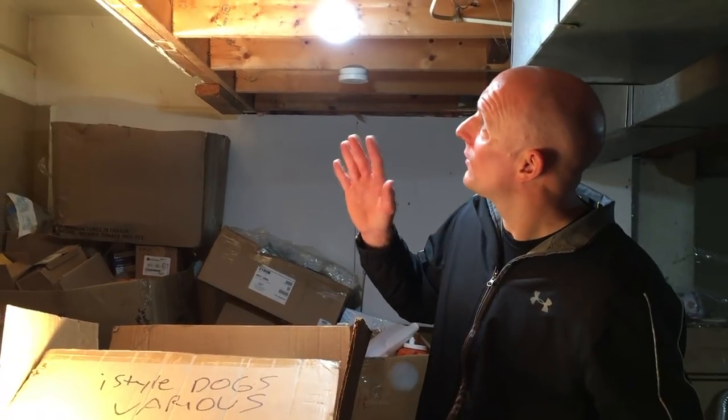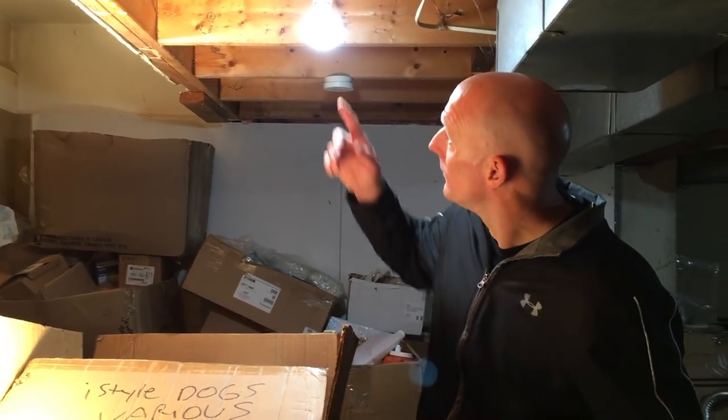We're not going to be using that. It's also a little harder for us in Canada to obtain these transformers. I've noticed on homedepot.com for people in the US it's very easily available right off the counter. Unfortunately for us in Toronto, Canada, I had to go to a specialty electrical shop to find this, or you can go on Amazon as well. The first thing before we touch any power — if you're not comfortable doing this type of work, it's strongly advised that you use a licensed electrician. But the first step you must do is disconnect the power at the breaker panel to make sure there is no power at the light which is also supplying the transformer.